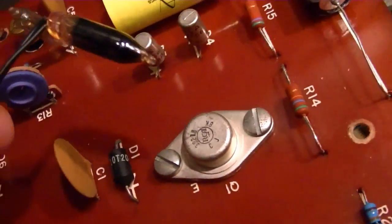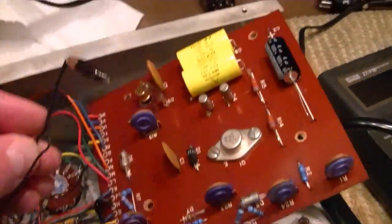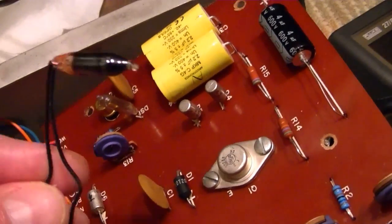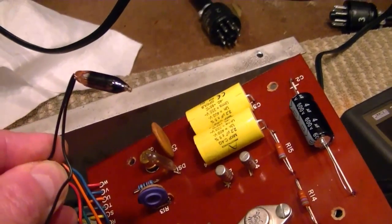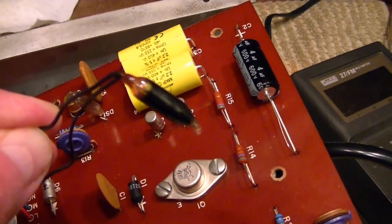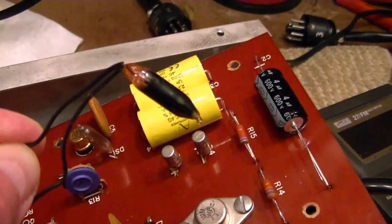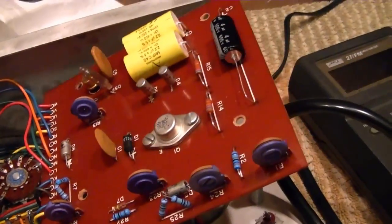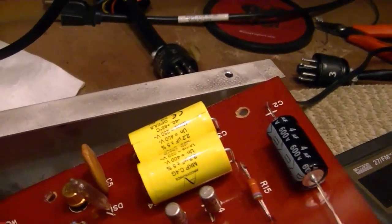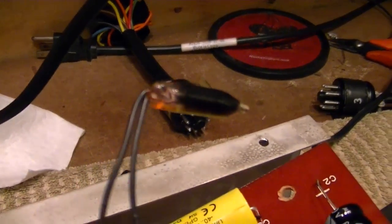But I see now why I thought it was glowing. I don't know if the camera can pick that up, but that's something else I read about, the dark effect, which is that you can get a neon light bulb to light up even when there's no power by having an external light impinge upon it, because it's causing electrons to get knocked loose from, I think, the nickel electrodes and ionize the gas inside. So I think before, when I saw it down inside here and it looked kind of like it was illuminated, it actually wasn't. It was just stray light causing it to ionize.